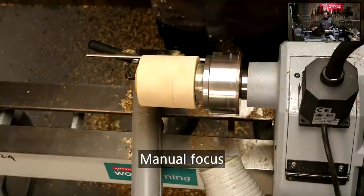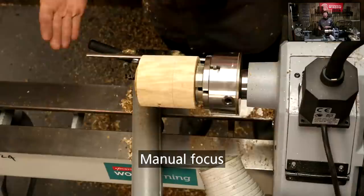Now for proportion - I always get asked about this. I work on two thirds and one third, so one third for the lid, or two fifths and three fifths for base and lid. This one is two fifths and three fifths for the base. We've already split them out with a pencil line. When drawing a pencil line, turn it away from you - if you turn the work towards you it snaps the pencil. Bring the tailstock up to provide pressure. We're going to use a nice small parting tool, one-sixteenth.